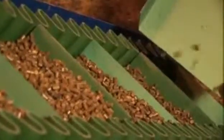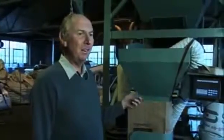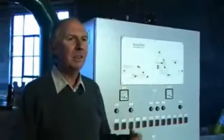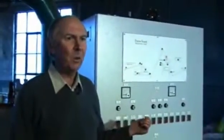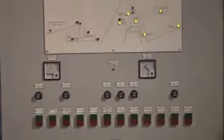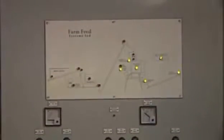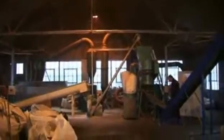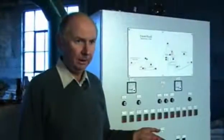to go into storage. Cooled pellets drop off the end of the conveyor into a pellet bin and then transfer into a bagging station. As you can see on the left, we have a control panel which operates the plant. It can be operated in manual or auto mode. When we start up in the morning, we'll start on manual mode. We get the plant and equipment up to operating speed, then we can switch to auto. When we're in auto mode, the plant will operate completely unattended.